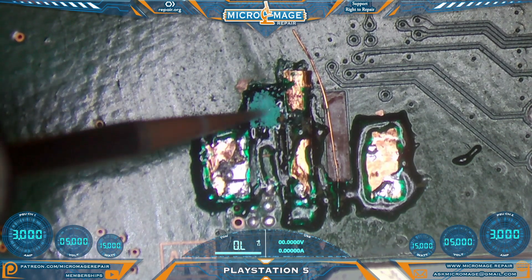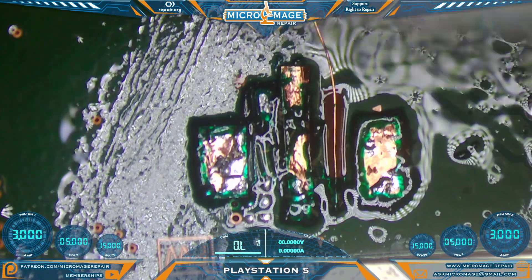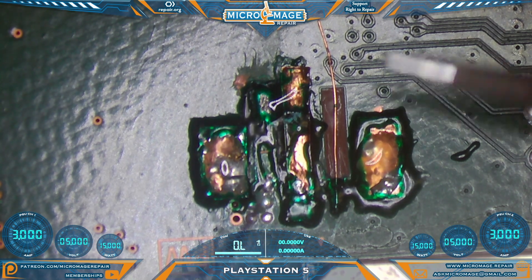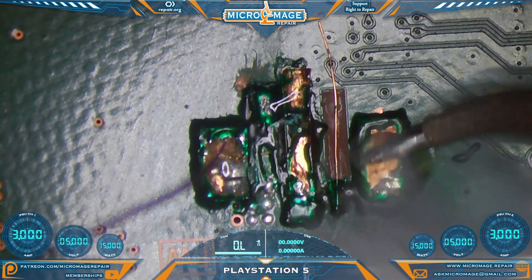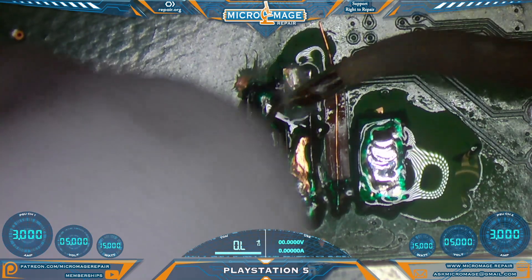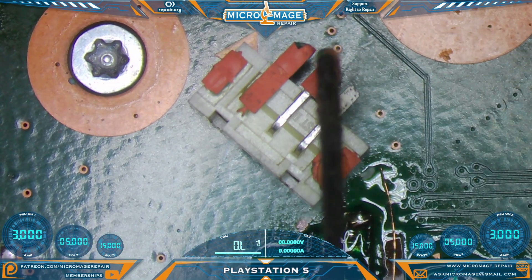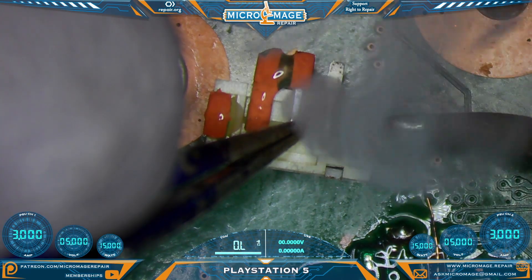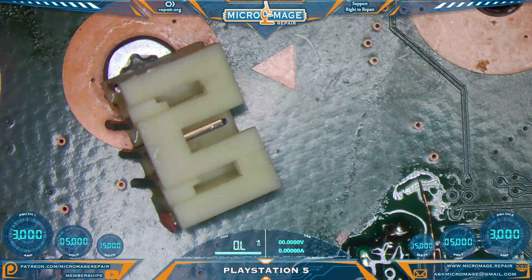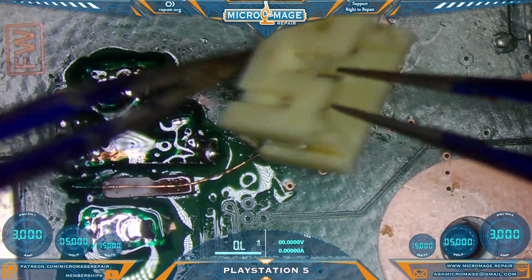Hopefully we are cured in place this time. We'll be getting a little more careful with our scratching. Just need a little of this pad to solder to. Add some flux. Now we'll tin our pads — nice and solid. Very nice. Next issue is we need to clean off this connector. I do have these connectors in stock, but when we can salvage the original, no need to use those. I have to change the angle of attack to make them lined up.